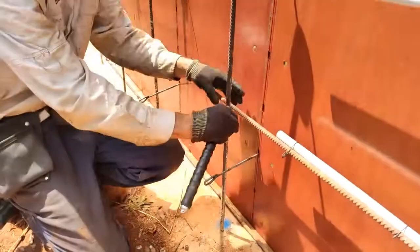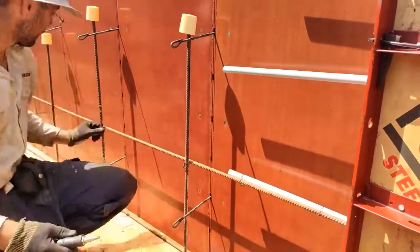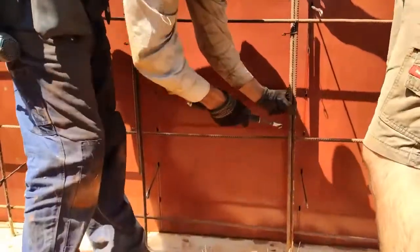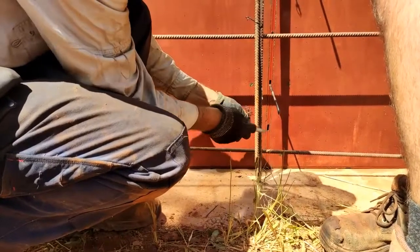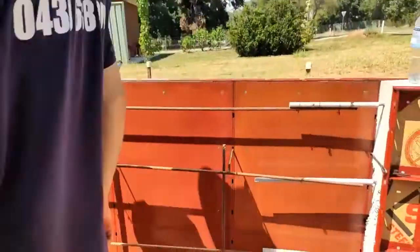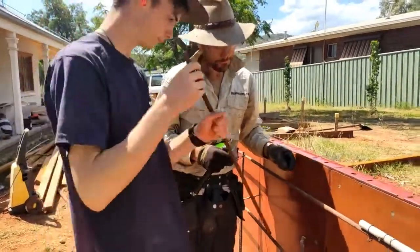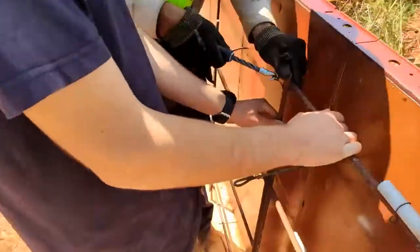The back of the rod here — you can see the face of the wall is on this mark, so I don't want to come out too close to the front of the wall. I don't want to risk anything poking through it. I'll probably just fold these down like that. So we're putting an extension on the vertical bar — doesn't need to be quite that long but that's just what I've cut. That's just so we can tie this extra top bar here because this is a little bit short. We've run this extra rod through — Hamish is running them in parallel to the other rod for me. After this tie, get that silicone and wipe in those ends.